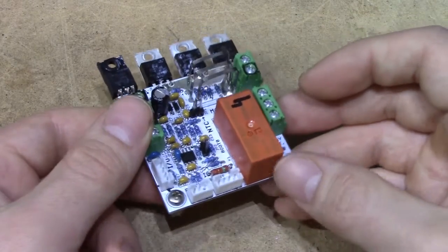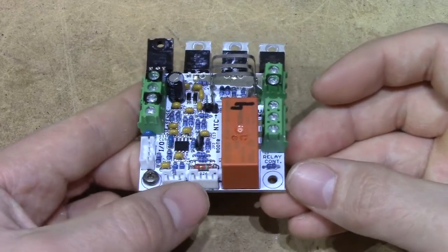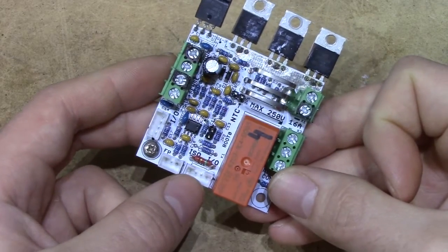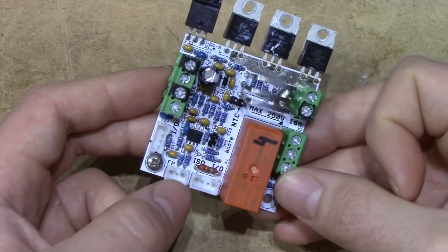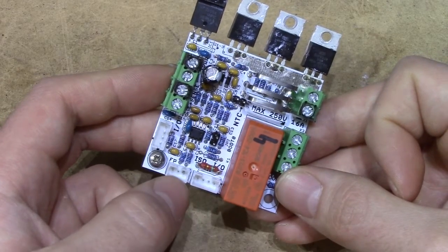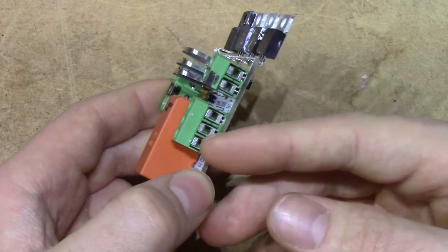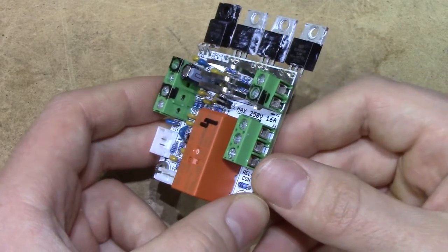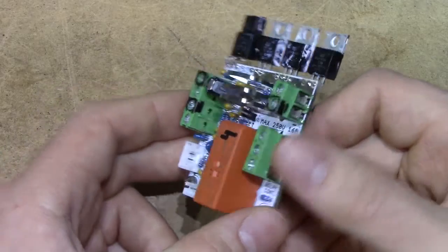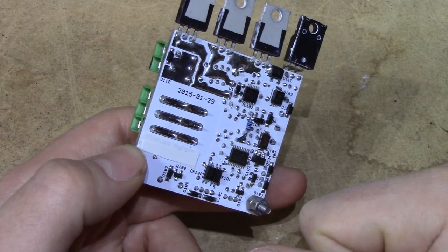We also found out early on that we needed to use some rather compact connectors, so we've used these 2mm spaced JST connectors for all the data stuff. We've got two IOs on each board, since these boards can be daisy-chained, and we also have one front panel header which has one LED output and one button. For the actual power connectors, we didn't want any custom stuff which would require crimping, so we just went for screw terminals — these are some pretty standard, although brand-name, 16 amp — or perhaps even 18 amp capable — screw terminals, same pin spacing as on the relay.